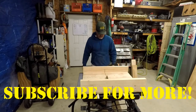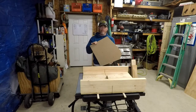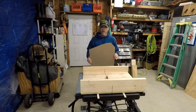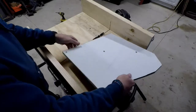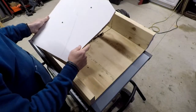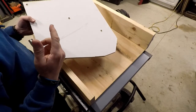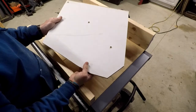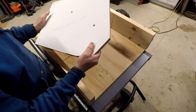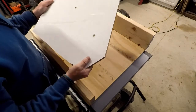So it's a pretty simple design — terribly utilitarian. This is my preliminary beta test of making a crosscut sled. Now we have to test it. I've got a chunk of MDF that I kind of hacked up at some random angles and we'll run this through a few times and see where we are. I'm going to run my first cut with this up against the fence. Let me get my hearing protection and a mask, because I'm cutting MDF and that stuff sucks to cut. We'll run a few cuts, check with a square, and see if I succeeded-ish or completely failed.